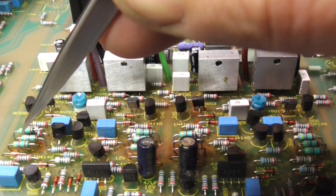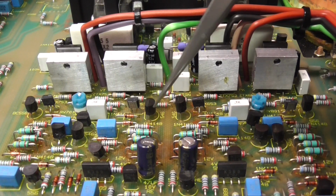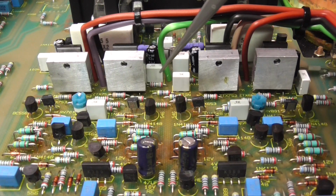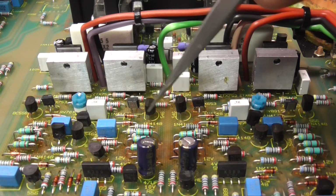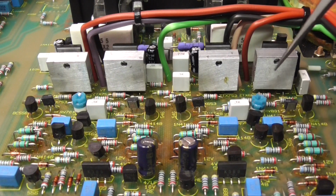They're running at sort of 70 degrees C. It's discolouring the board, so I've raised those up. The resistors that I took out were fine, and they hadn't really discoloured, but the trouble is they're running at probably 70 or 80 degrees, and they're designed to. It's just discoloured the board, and I just think it looks horrible.